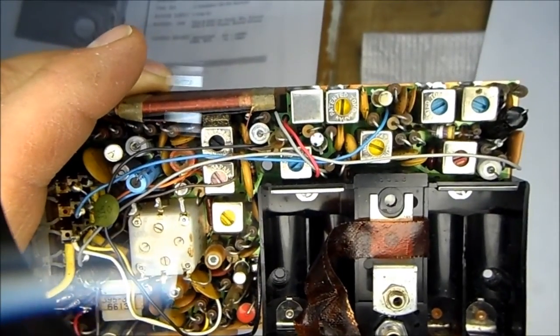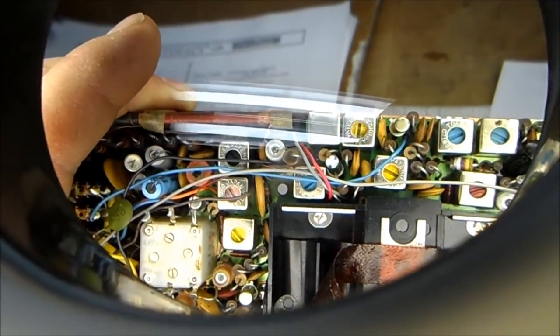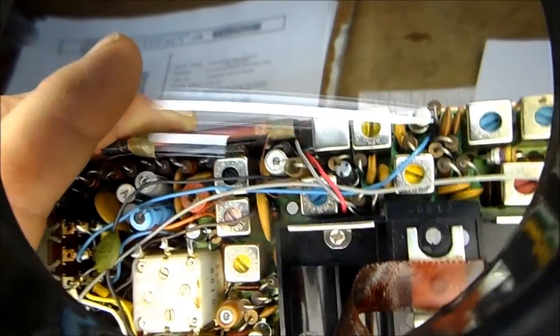So I don't mess this up, I've gone and marked it: the emitter is green, the base is blue, the collector is red, and the black is the shield. What I did is I just took the picture and looked at the top of the transistor and read it backwards. So counterclockwise from the tab should be: emitter, base, collector, case — and that's looking from the top.